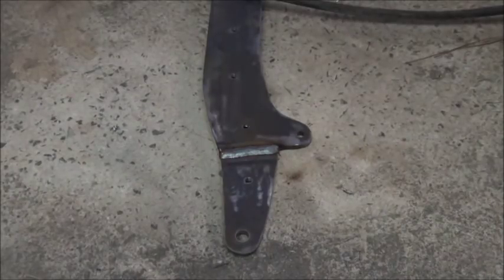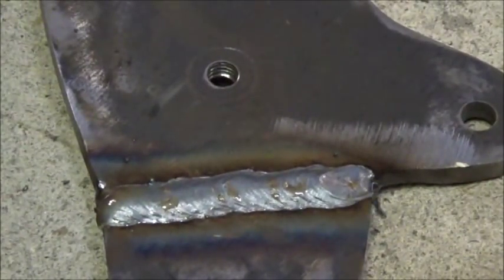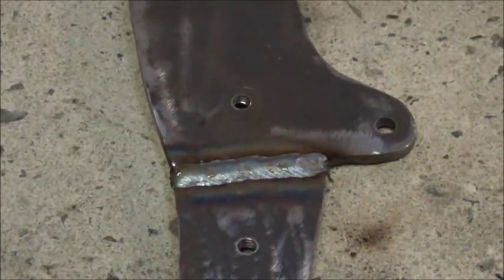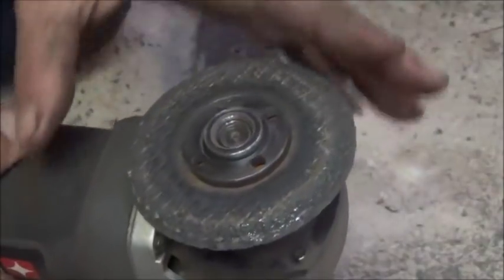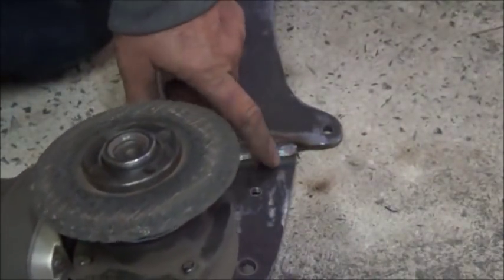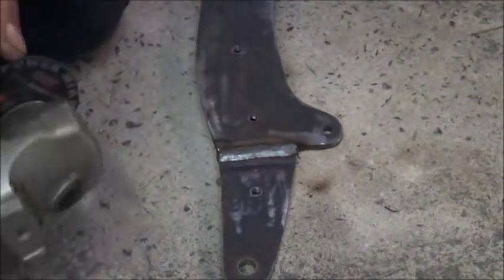What we've got here is a weld and I'm going to show you how I do this. This is quarter inch plate — old used steel that I cut one of my forks out of. I've welded it up and now I'm going to grind it and try to smooth it so you can't tell there's a weld there. First things first — safety glasses, bifocal safety glasses if you're like me. We're going to start with a regular grinding disc — a coarse disc — to take the main weld off. Try not to get into your metal too much; you don't want any really deep gouges. Just bring it down until it's a little bit above surface.